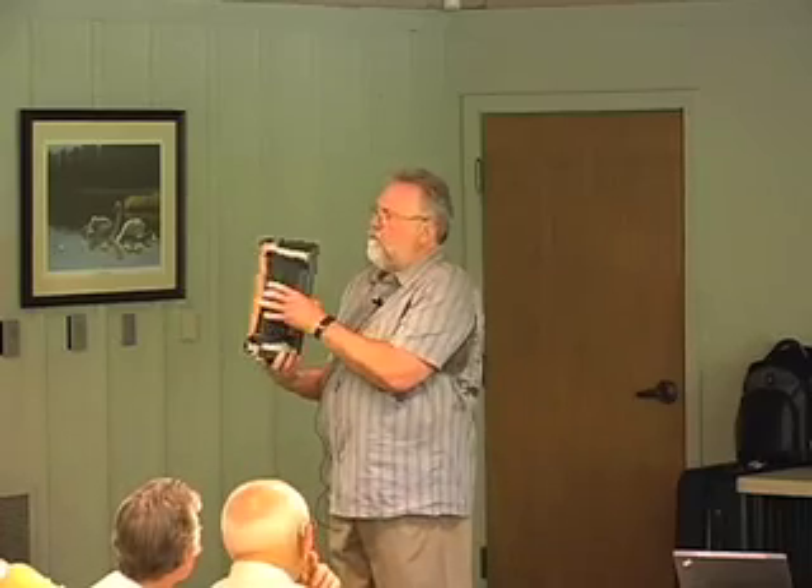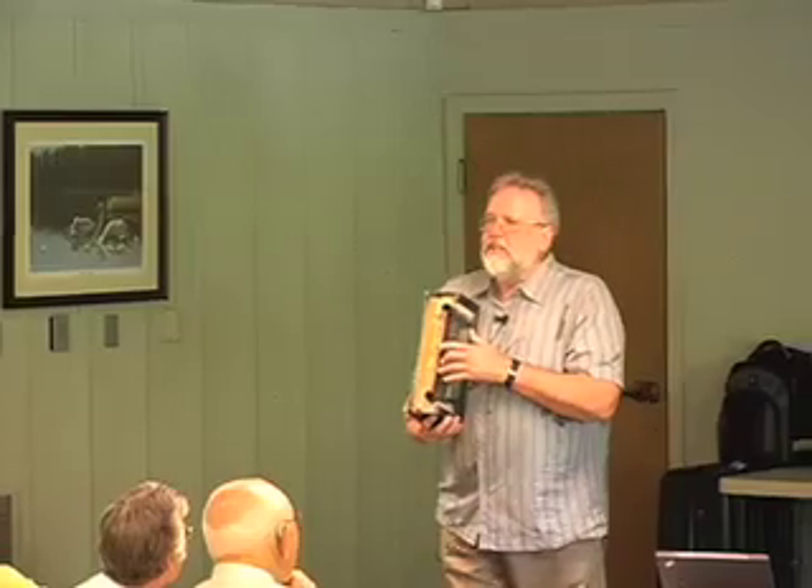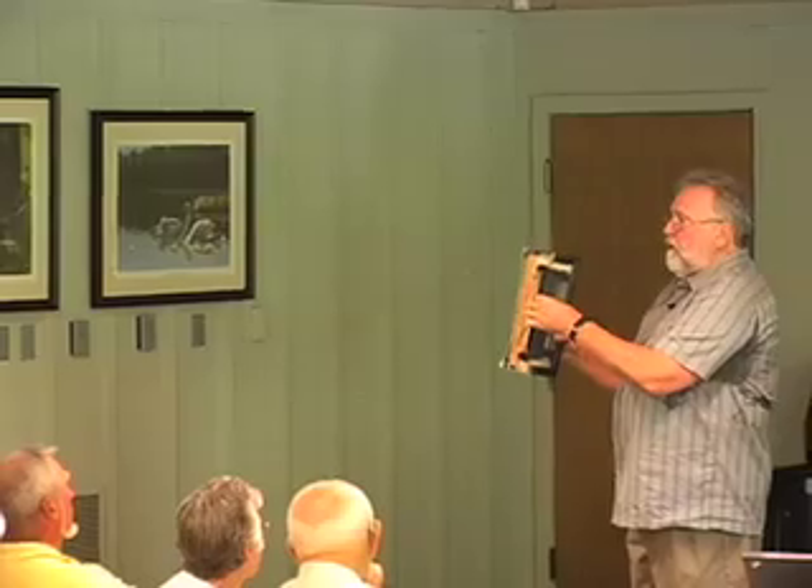And then there's glass. This has plastic on it because if I carry around glass, it always gets broken. But the glass used in all collectors is tempered to start with, which is the same as safety glass. In all probability, this window glass here is tempered too because it's right next to a door. Patio doors and shower doors are all tempered glass. Tempered glass withstands a whole lot more abuse than regular annealed glass.